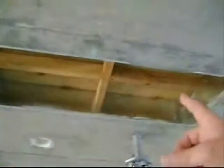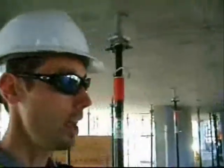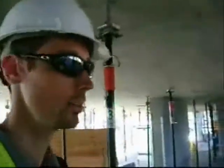Okay. So Ryan, as we walk by, here is how far heating, ventilation, and air conditioning can get. At this point, they've come up to this floor, and this then will go to the next level. Exactly. Like Casey pointed out before, they have to form these sleeves or blockouts or shafts inside the concrete to allow the ductwork to extend through. So that's what we're looking at.